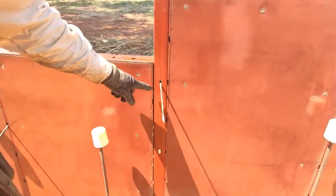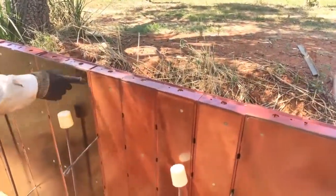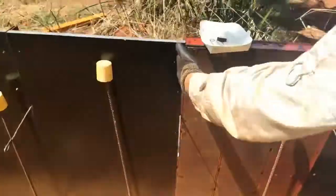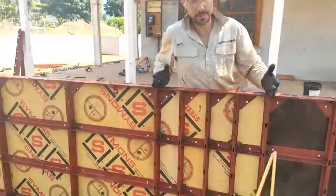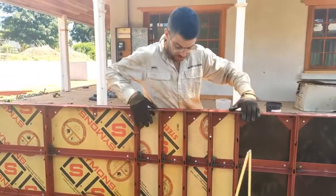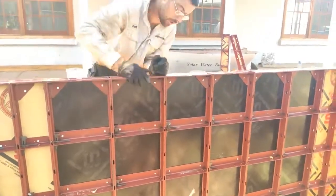We've got a filler piece — I can't remember the name of them — just to step the wall down. See, it still ties it together: a two-inch filler. What we've done here, just to use up all the panels, we've put 150s, 300s, and 200s in the wall, plus plywood, but we've done them all in 600 increments — 600, 600, 600, and 600. For a section on the back of the wall where it's not as obvious, we actually make them up with three rows of pins in a section of 600 because it gets a much straighter panel. Where we've joined it here we've only put two sets of pins holding the ties — that's plenty.